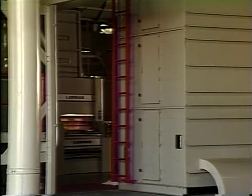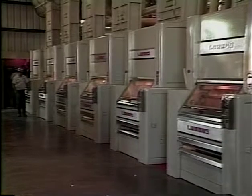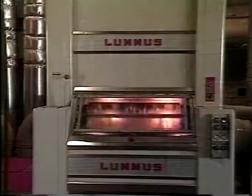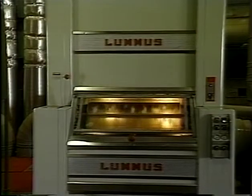In roller gins, the drying and seed cotton cleaning systems are similar to saw ginning, but the gin stand and the lint cleaning are quite different. Roller gin stands separate lint from seed by using the frictional forces between a moving roller and a stationary knife. Cotton is ginned as fibers adhered to the roller surface slip under the stationary knife which holds the seed. Each stroke of the rotary knife clears the stationary knife edge of the accumulated seed cotton and gin seed. Partially ginned seed are either pulled back to the stationary knife and completely ginned, or swept along with the seed and carried over and reclaimed later in the process.